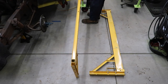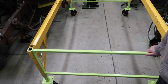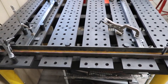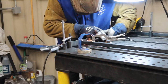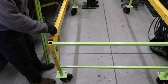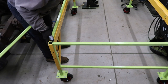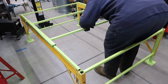The scaffold's quick connects make the dolly easy to put together. However, as you can see, they aren't very good at keeping the dolly corners at right angles. To address this issue and also to give some additional strength, we created cross bracing using C-channel and some one by one steel tubes. One other issue was that the scaffolding has a lip that could be crushed by the weight of the truck bed, so we used some more of the one by one tubing to ensure that didn't happen. With the additional bracing, the dolly comes together very nicely and stays rectangular.